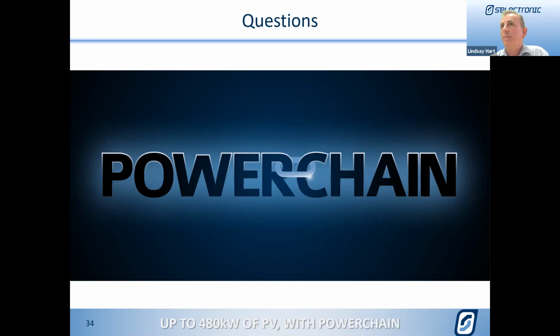So there's a couple of things. I'll answer it as two questions. What distances do we support between inverters? If we're talking SP Pro inverters in a Powerchain system, that's really determined by the fact that they've got to be within the same area to connect to the same battery bank. So it's not really a matter of comms, it's a matter of you've got to physically have them all connected to the battery bank. So that distance is really down to what is practicable and reasonable so that you don't have very long DC current runs between inverters.